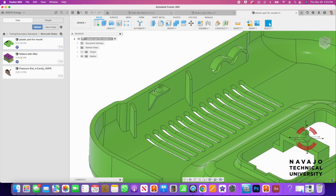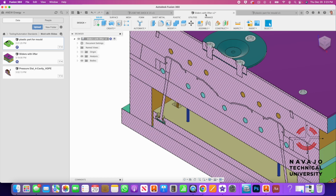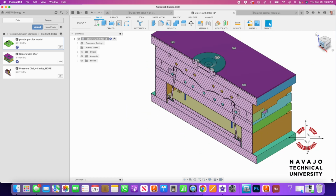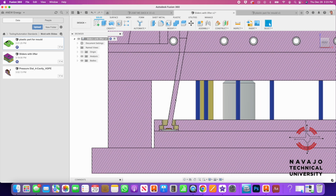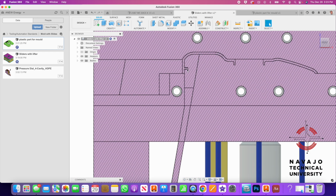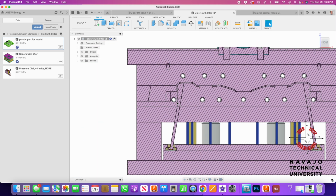So here's an undercut that's on the inside of the part, and right here. So we have to pull away on the inside of the mold, and it gets really tricky. So I'm going to show you the mold design on this particular part and why it costs so much money, why it takes so long to make, and why it's a maintenance nightmare where there's always potential problems. So we're going to go into this tool right here, and if you look at this, our ejector system is down here, and we've got to be able to push with a bar, and it's going to lift out from this undercut here, and it's got to be able to travel along this flat edge as the ejection takes place, and this all wears, so it becomes a big problem.